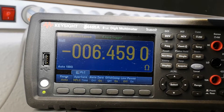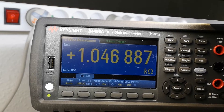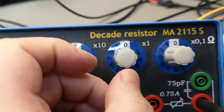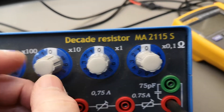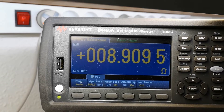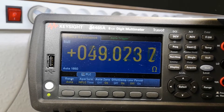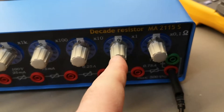All the settings on the one ohm - there's one setting that works: disconnected and the short. Those are the only two positions that work, but it reads one kilohm, which is odd. This is 10 ohms - one click on the 10 ohm setting is nine, and then again 18. So again the first is a little bit out of spec and all the others continue. This continues all the way up, so this is the one we need to look at.